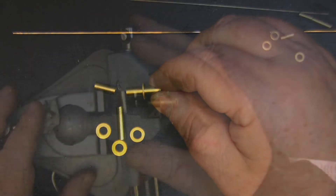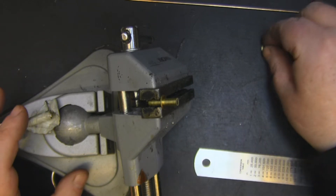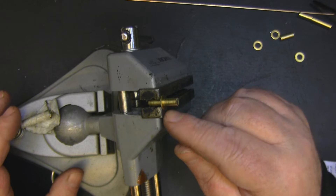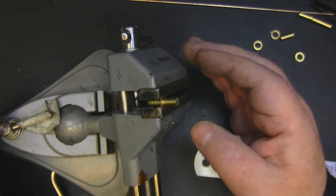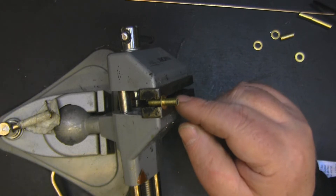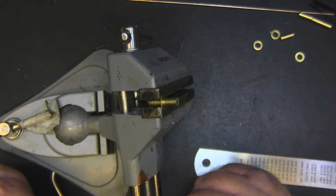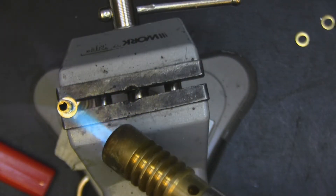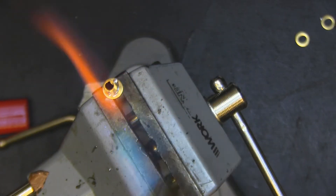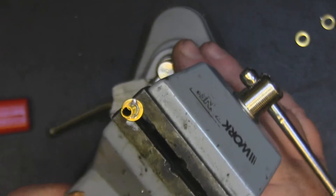The best way I've found to solder the washers is to hold the tubing in the vice, get your measurements correct so the washer is directly in the middle. These washers have a rounded side and a flat side — lay the flat side down onto the jaws of the vice. Use a small blowtorch to heat up the tubing and the heat will spread to the washer, then feed some solder around the washer and it'll flow nicely.